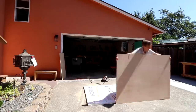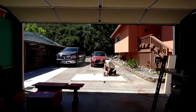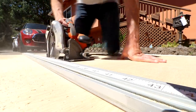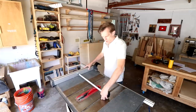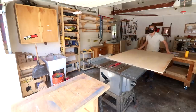This is the kind of thing that varies from project to project — I just have to think it through each time. There are two things I always have to consider: the accuracy of my circular saw cuts and the size of my table saw. If you have a big table saw or big outfeed and infeed tables, you might be able to cut the entire sheet of plywood on your table saw. But I don't have that. Cutting those pieces to 18 inches wide is pretty easy since they're all the same width, but that big piece is right on the cusp of what I want to handle on my table saw.